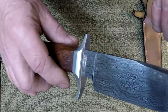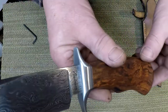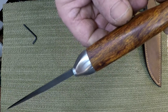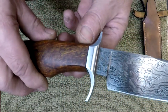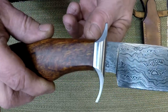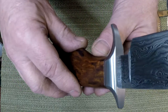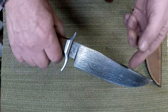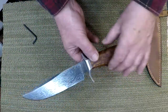I hope we can see the fit and finish on this guard. Notice the finish particularly on the guard — it is untouched by my hands, completely machine finished, yet I spent a lot of time dialing in the small wheel, soft platen, slack belt, etc. It is just a really nice finish that a person doesn't need to be real concerned about. I'm not going to spend a lot of time on hand work and fine details only for it to be abused, so this is a utility grade SOB.